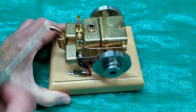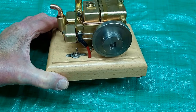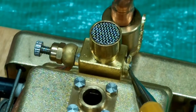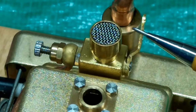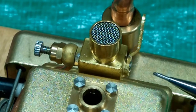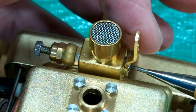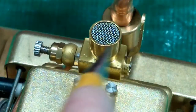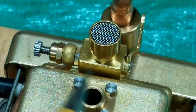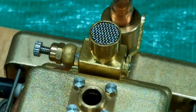Not all of the carburetors have two needle valves, but these do. This is your high speed needle, and this is now about a quarter of a turn open. Inside the carburetor there are two sets of seats — a seat for the high speed needle and a seat for the low speed needle. With the carburetor barrel wide open, we adjust the air-fuel mixture for high speed. Then as we close this, you watch this part of the barrel — it moves in, bringing that needle closer to its seat. We adjust that so the engine runs properly at idle, then open it up again and see how it runs. We readjust the high speed, close it down, and see if we need to make changes. There is some interaction between those two needles — the high speed affects the idle speed.